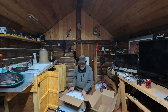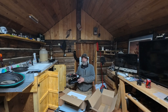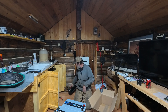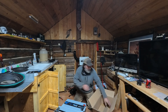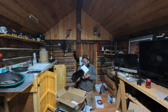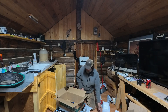They sent me two things. First one is a 70 amp 12 volt charger for lithium batteries — that is a massive amount of power going from this charger into the batteries. I'm looking forward to that. This is more powerful than the charger I have for the house, because the max that one does is 60 amps, and that's also a 24 volt system. It comes with a plug to plug it in and an Anderson connector to connect it all together. Then we have the second item: a 12 volt 2000 watt inverter, and that will literally make this cabin standalone. It's got an on/off switch that can mount somewhere.